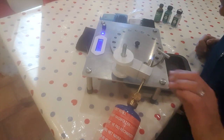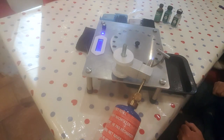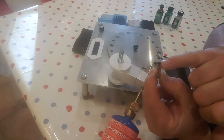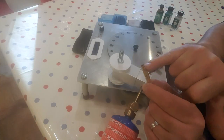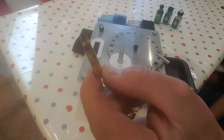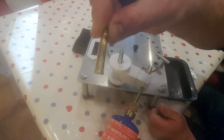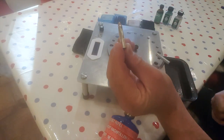The flame isn't quite in the right position, so I'm adjusting it a bit further out and looking for the colour change on the case. What happens is the green paint inside the neck goes clear. The two dots on the outside change colour in the flame, but they go black so that's not very handy. We're more concerned about what's going on in the body — and you can see the lower two dots are intact, so the heat hasn't got above 450 anywhere near the case head.